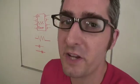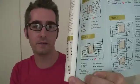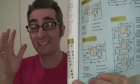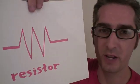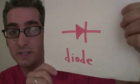For those of you who haven't done electronics, you're probably wondering what all this stuff is. So let's take a quick little learning break. The awesome thing is that these little schematics are like maps that show you where things go. Once you know what the symbols mean, it's really easy to figure out what connects to what. If electricity can be thought of as water running through a hose, a resistor is like putting a big kink in that hose — it slows down the flow.